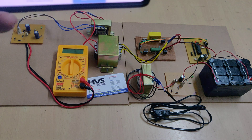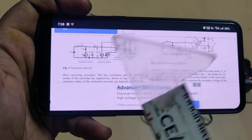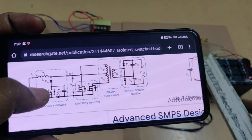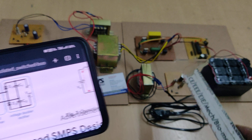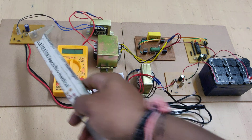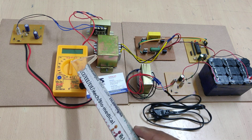This is the battery input, and both inputs are combined in this circuit — that is the impedance network circuit as well as the switching network circuit. From there, after the switching, we get the AC signal, which is the input to the isolated transformers, and from there to this voltage doubler circuit.